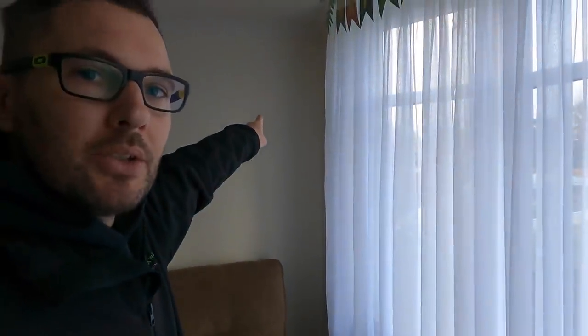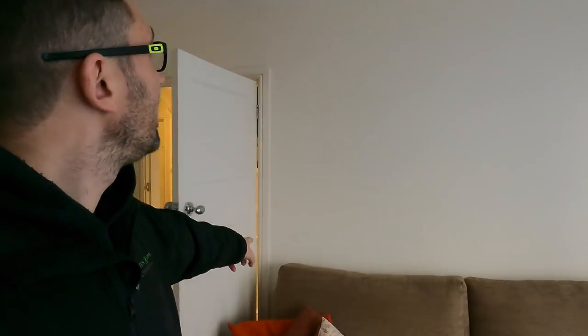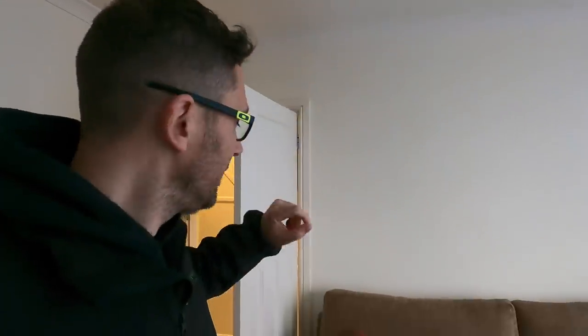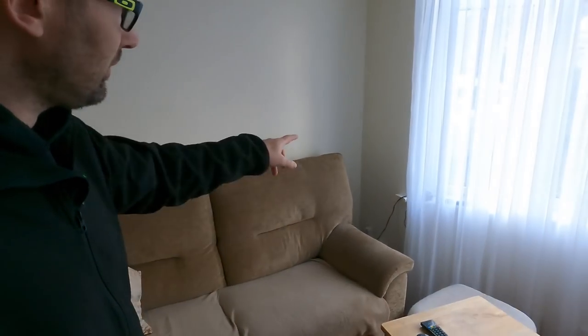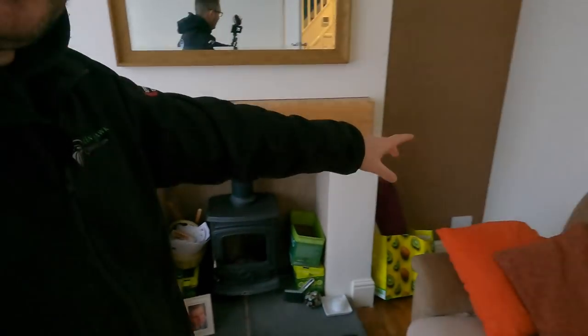So in here, my plan is to go up into that little bedroom and then come down in a chase in that corner, either that corner or this corner, depending on the furniture above. That one will be chased in and filled, and then we're going to go underneath this wooden floor, and we've got a socket there, one piggybacking into the hallway, sockets behind the telly, and then we've got the socket in that corner. So that is the job. Like I say, Jack is getting on with getting all the kit out, getting his stuff sorted.